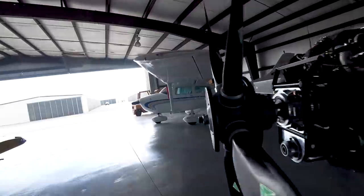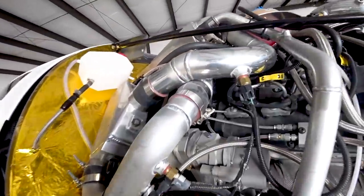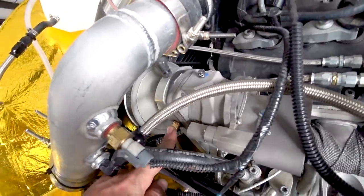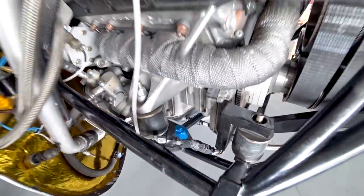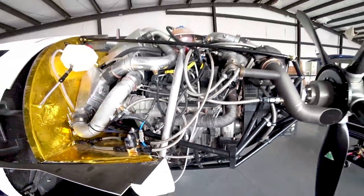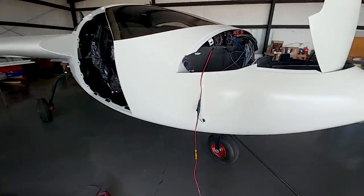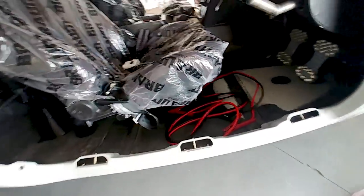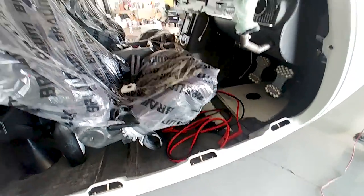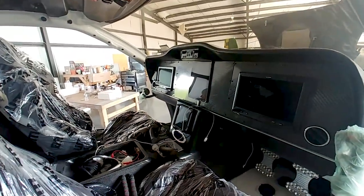While installing that, I also had to block up the oil feed lines and the return line. There's one of the feed lines coming out of the governor, the other one I just showed you, and this is the return line. I put caps on all of those so we don't have loose lines. It's a total bummer having this happen, and I've got the battery on the charge as well, just to keep that topped up. It's such a blow to have this happen now.